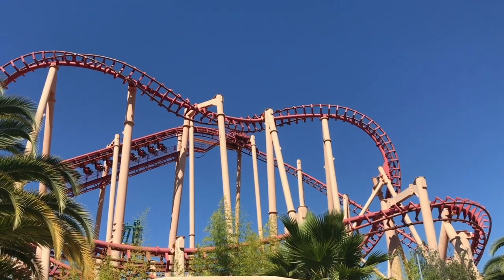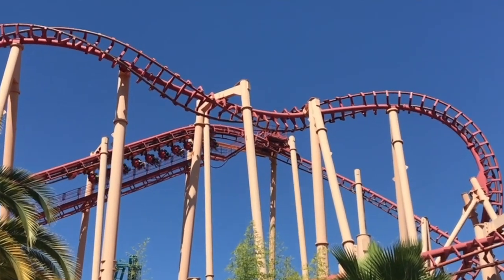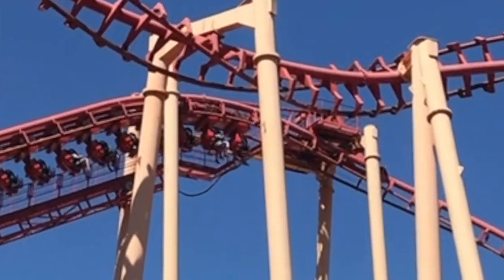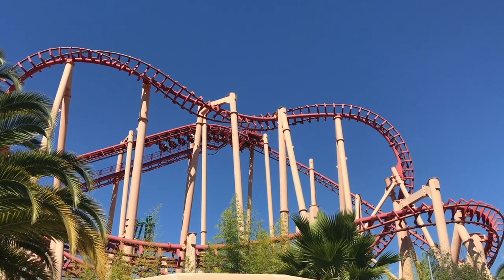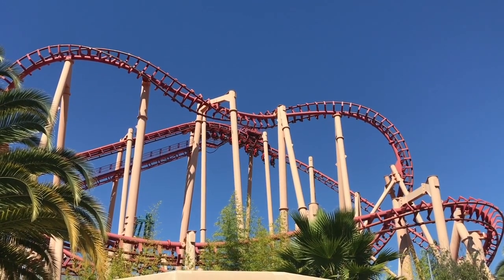But at the very top, that's where on the SLC they've put their motor. So at the very top, there's the bull wheel up there. So if you see at the top of a ride that there's a lift motor up there, that's the bull wheel. And then you have the tail sprocket, and on the SLCs, the tail sprocket was also the tensioner sprocket. So there were only two on that ride, as opposed to the B&M I worked on, which had 1, 2, 3, 4.